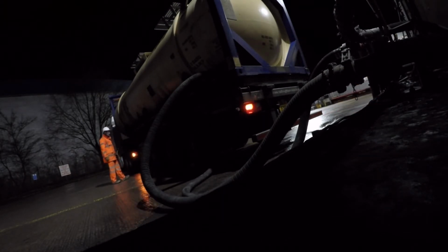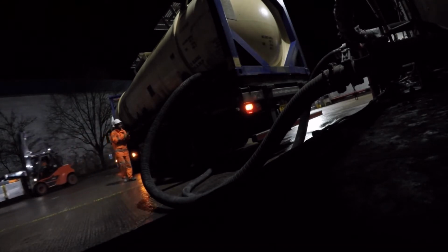One final check. Are we getting towards 1.5 bar? Yeah, we're about there now, so close the aeration valves on aeration bed 3, close the valves on aeration bed 1, so it's just the middle one now, aeration 2. Open up the boost valve just a little bit, that supplies raw air from the compressor line straight into the discharge line, which aids all the product to go up.